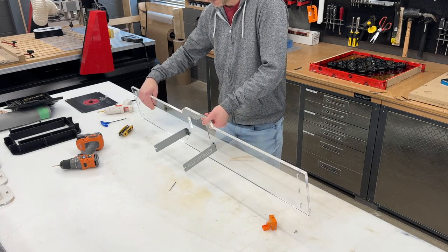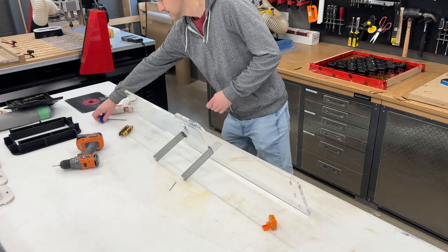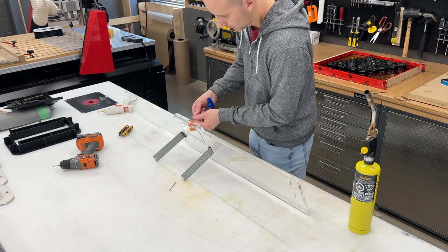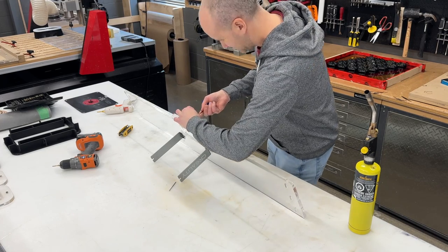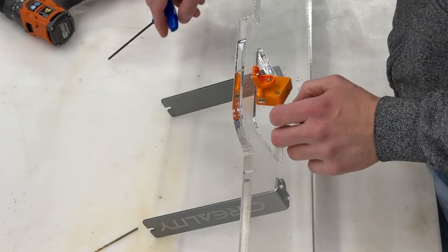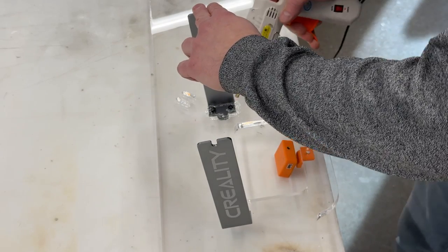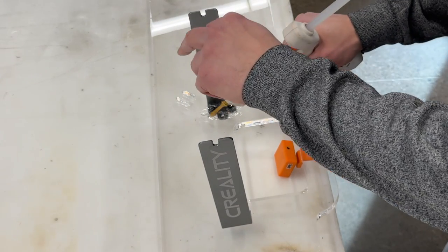Next I'm going to turn this thing over and put the runout filament sensor on. The screws that the runout filament sensor comes with are really small, so I just heated them up — what that does is it melts the acrylic as I screw into it. I probably should be wearing a mask at this point, you can see all that acrylic melting there. But once that's set, it's essentially threading the screw for you, and you can see that runout sensor is mounted at the bottom here, which is going to work just as well as the factory setup.